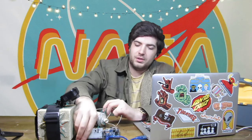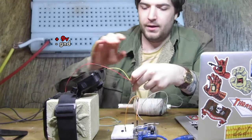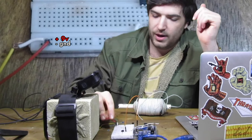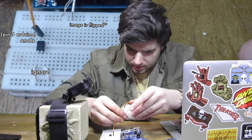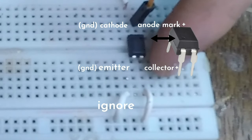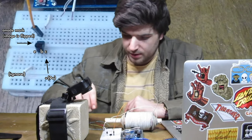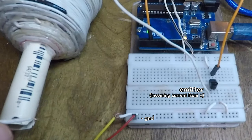I'm going to use my opto isolator here because I like separating high power stuff from low power stuff. This is my external 9 volts — the yellow wire is positive and red is negative for some reason. The anode connects to pin 3, the cathode goes to ground. The emitter pin and collector pin on the opto isolator: middle pin goes to the emitter, and that last pin is the collector. The input of my coil is going to connect to the emitter and the output connects to ground.